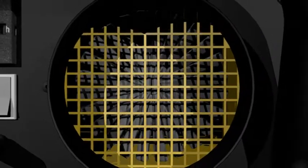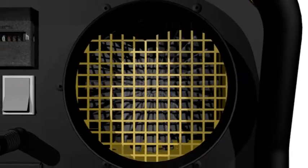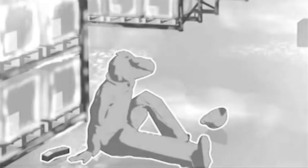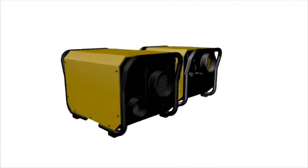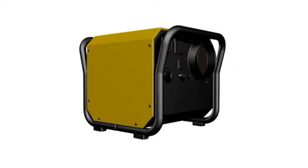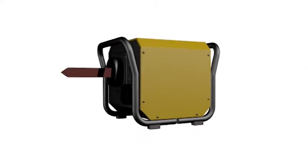Benefiting from twin turbo fans, the EPD-200 4-hole design allows sealed room drying, ideal for focus drying applications and drying tents. It also allows drying commercial freezers, helping prevent accidents through slipping, energy efficiency, and helping food to last longer. The EPD-150 has a single turbo fan, a 3-hole design, great for the most common way of drying any space. EPD-200 can work also in 3-hole mode. Just place it in the room, attach the hose, and vent moisture to the outside.